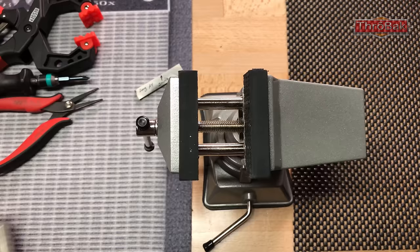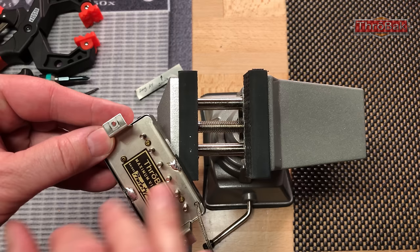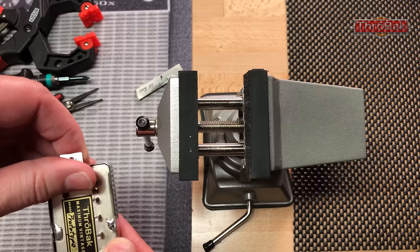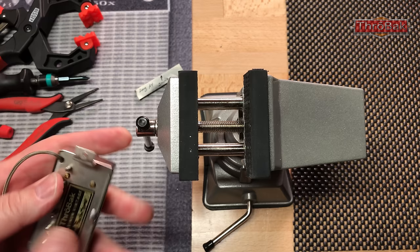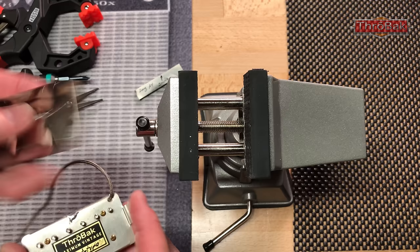This requires just a little bit of persuasion with a small screwdriver to loosen it up. Sometimes you can get solder that flows a little deeper between the cover and the base plate, and you might have to pry that open just a touch — not too hard. But once you get that free, gently take this off. Make sure that there aren't any sharp edges of solder on the cover that might cut into the tape.